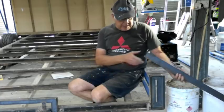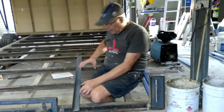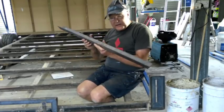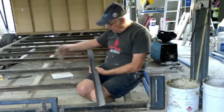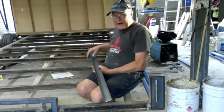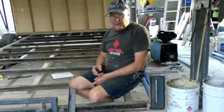Having built more than one car trailer down through the decades, I like to make my car trailer floors out of steel. In the past I've put 50mm angle where the inside edge is and then just cut strips of sheet metal steel. The advantage of this is it gives you an inside edge so the wheels won't fall off — if you get out of square as you're loading the car, it'll keep the car on the trailer. But the disadvantage is that adding angle adds weight.